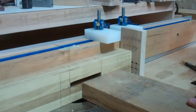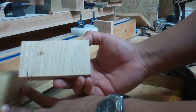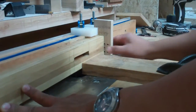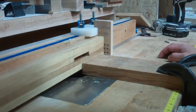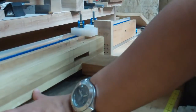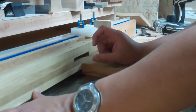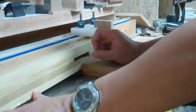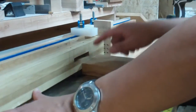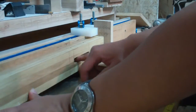I'm going to tighten that down. What you want to do is basically prop this up — get a block of wood and prop up your gun block so that it's held up off the table. The procedure we're going to use is to lift your router bit so that you incrementally raise it an eighth of an inch at a time, then peek through here and keep doing that until it breaks through the wall of the gun.